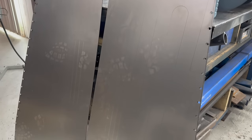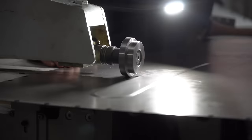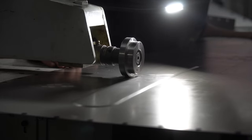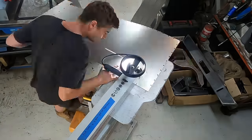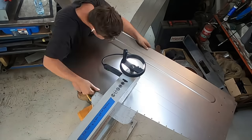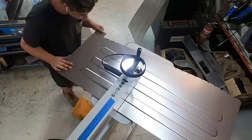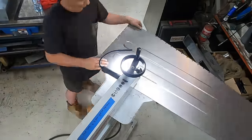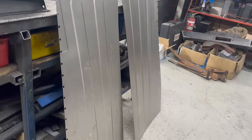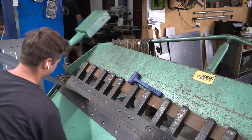The floor is cut from 1.6mm steel and then ribs are bead rolled into it to add stiffness and also make it look great. We've used the laser to etch the marks for the ribs accurately. Once both sides are complete, Connor can put the returns in them to add strength. These were intentionally left until after the bead rolling so they didn't interfere with the bead rolling machine.